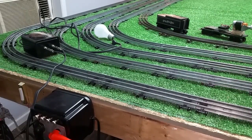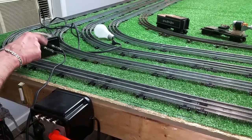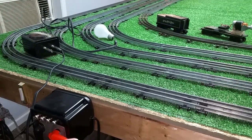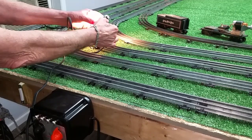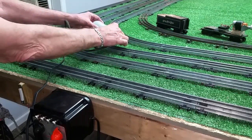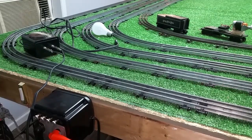In this case, it works absolutely perfectly. Two transformers — the output of this one connected to the output of this one — turn it up all the way and you have 110 volts coming out of the cord. As you see, you have 110 volts coming out of that transformer. It's a really simple way to get around the problem of running 110 volts someplace where you don't want to run Romex.